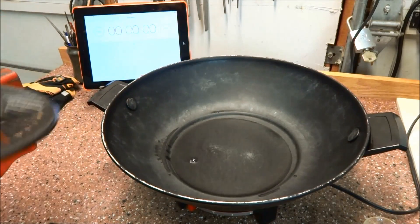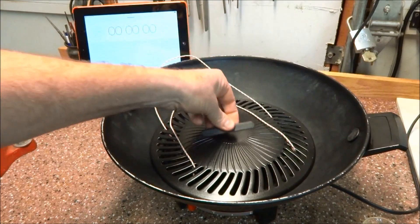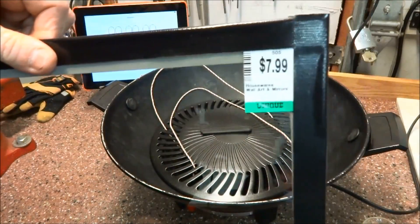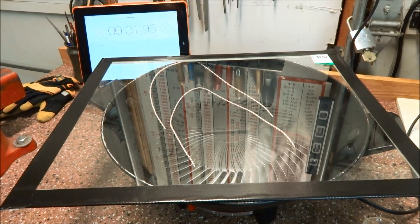The wok is already on the lowest setting. We're going to dump in our 20 to 25 cc's — it immediately starts to boil. We place our tray on top, then set our part on top of that, and cover it with a piece of glass, also from Salvation Army for $7.99. What's happening is the acetone is vaporizing, forming a little cloud inside. The acetone then condenses on our part, filling all the nooks and crannies and little crevices, condensing evenly all over the entire part rather than concentrating in one or two areas. It should give us a pretty nice finish.